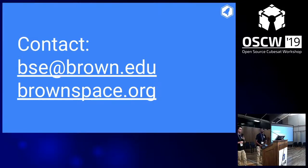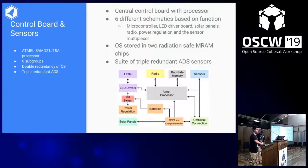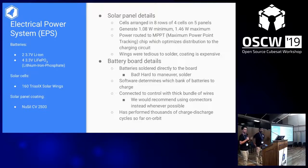There are two banks, charged together — four batteries in two banks of two. That can be a problem because sometimes the two batteries in a bank are not perfectly identical. We anticipated a slight problem and it has been a slight problem — we know the batteries aren't perfectly charged together in a bank, but we haven't observed any issues with that yet. Q: Great presentation. I'd love to see more pictures. Also, how did you make the CAD model? A: It's CAD in SolidWorks. We're going to use OnShape for future models. Q: Did the batteries need any encapsulation for space and vacuum? A: We didn't need to protect them mechanically — they're from the same manufacturer as lithium-ion batteries, same shape, the only difference is the internal chemistry.